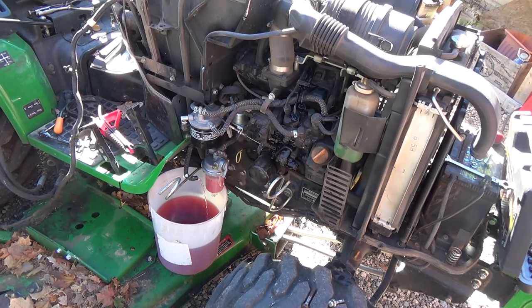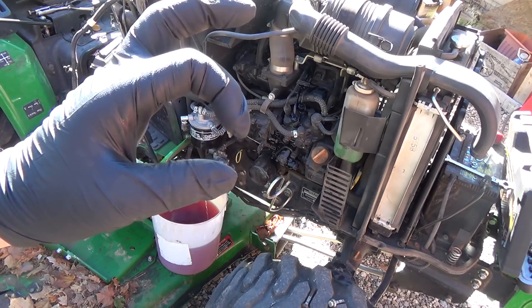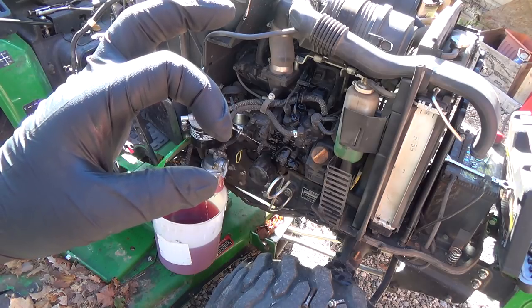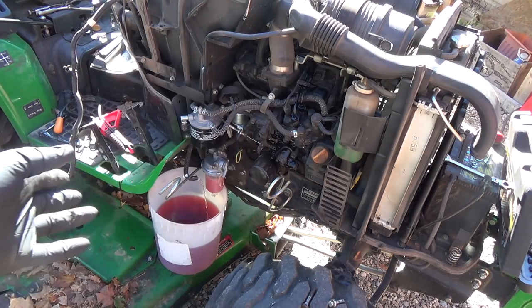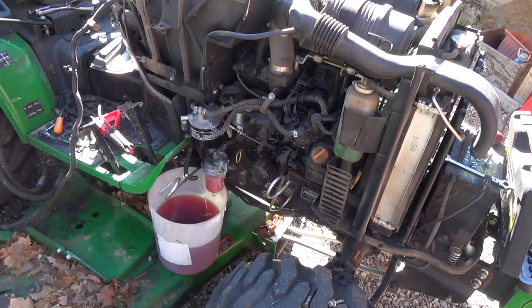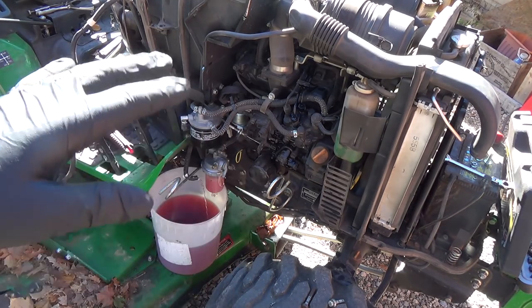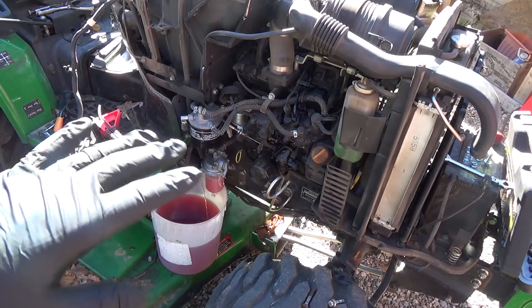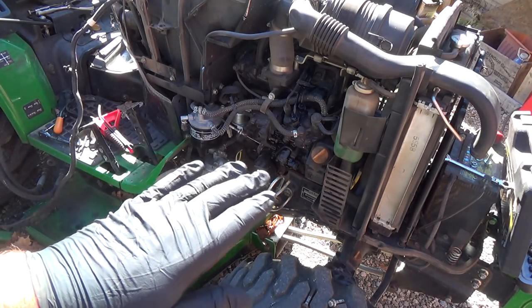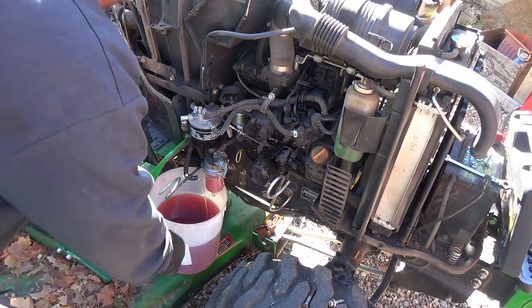So he took the tank off, and what he dumped out was one of those protector caps off of the bottle of injector cleaner stuff that somehow fell in there. I think it was actually a little aluminum cap thingy, and it got moving and then traveled, and after it sat a bit, it moved away enough that it would run again, and then this cap kept getting sucked down onto the thing there, right? So it's like, what a nuisance that was. But he ended up figuring his problem out, which is good.